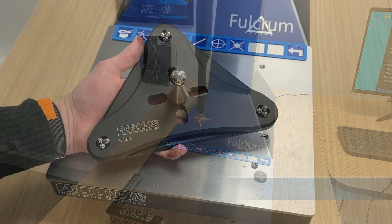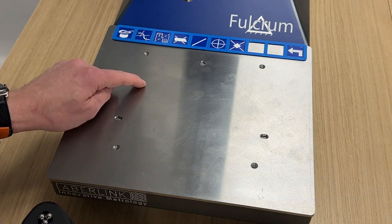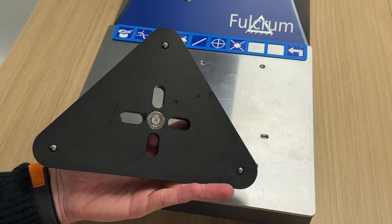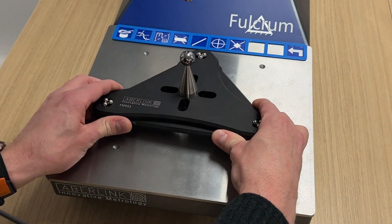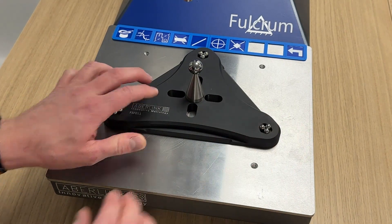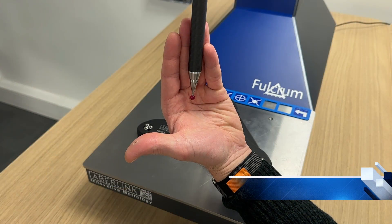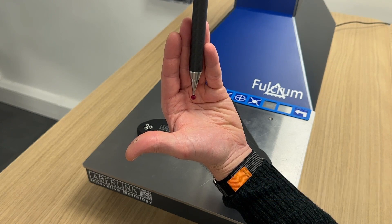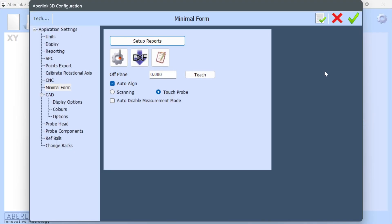The Fulcrum uses a kinematic stylus datum plate to calibrate all stylus. The steel base plate on the Fulcrum has three precision-ground slots. On the underside of the kinematic stylus datum plate are three ground balls and a magnet — the three balls sit within the three slots and the whole plate is held in place via the magnet. This means it will locate in the same place every time and stay secure during datum cycles. We'll start by calibrating the 6 millimeter straight-down stylus from the 2.5D kit. We will now open up Probe Manager by clicking on the gear icon in the top right-hand corner of the screen, then click on the stylus and gear icon.